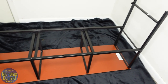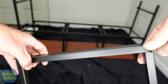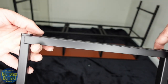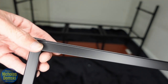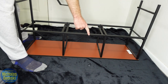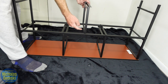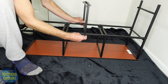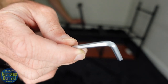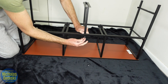Now our drawers should be looking like this. We go back to bag ACG and take out two more M6 screws, and we're going to need piece number eight, which looks a lot like pieces number four. Make sure you're paying attention to where the closed-off end of this bracket is and where the open end is, and align it correctly with the other pieces already installed — in my case the open end faces the camera. Take the brackets and make sure they're positioned above, then come underneath and get these screws started up into piece number eight. After those are started by hand, take the hex key and tighten them — just enough to hold in place, not so much that we can't make adjustments.